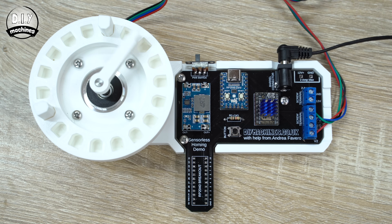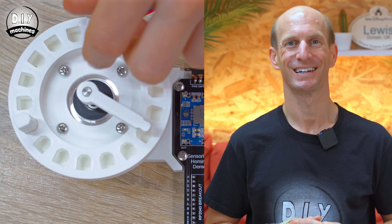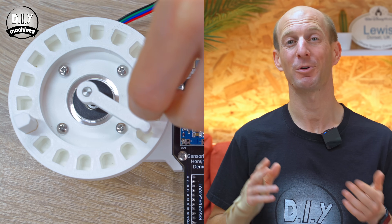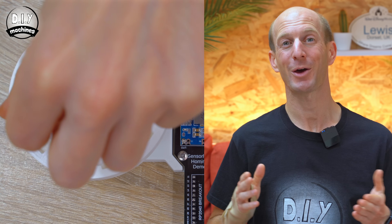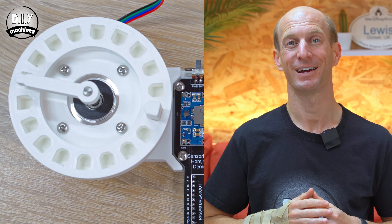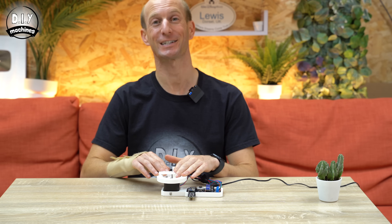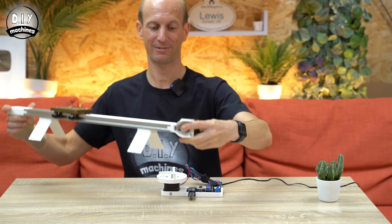If we click the button a second time, the demo will be repeated at 1200 Hz. The onboard LED will flash green when the StallGuard value has been crossed, and red when the stepper is centered. To mix up the test, we can move the two end stops and click the momentary button again. The stepper will find the two new positions for the end stops and return to center. Of course, sensorless homing isn't just for rotational movements — you can also use it on a linear movement such as a slider rail.